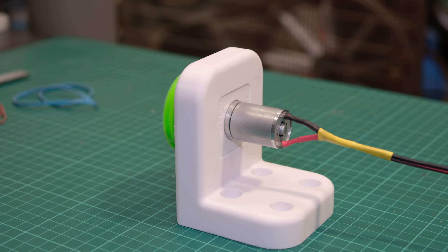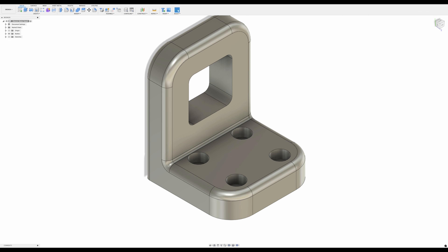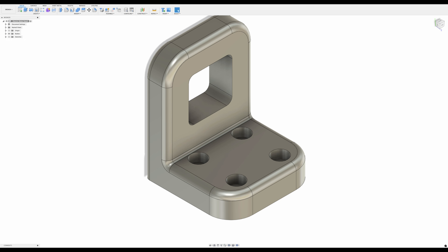The first step was straightforward: design a motor mount and bracket. I created a 40x40x20mm block with R5 fillets. The 404020-R5 motor mount attaches to a dedicated bracket, and that bracket is then fastened to a 160x40 aluminium extrusion. Suddenly I realized this wasn't just a one-off part — it was the beginning of a modular system.